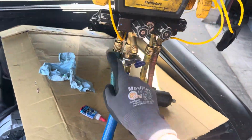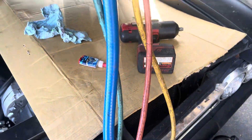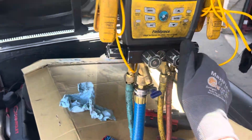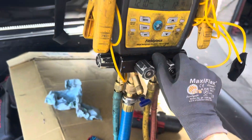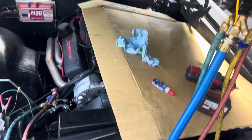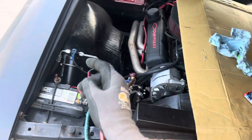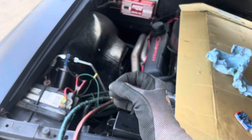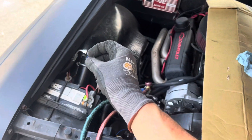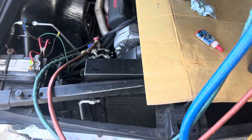I filled it up on the high side. Now I'm going to drain it on the low side because we're using it as a flush. I evacuated it before I put high-pressure nitrogen in it, and now I'm going to evacuate it again. It's all brand new equipment — all the vacuum plugs, everything was sealed and tight from the kit, so nothing had air exposure. When all the plugs came out, you got that little hiss of dry nitrogen in the system.